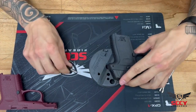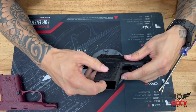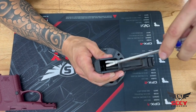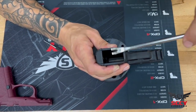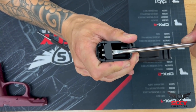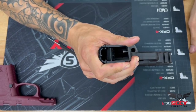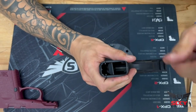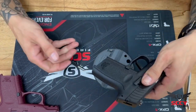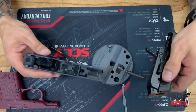After removing the rear frame pin, I'm going to move on to taking the butt cap of the hammer spring out of the grip. To do so, I'm going to use my fork tool — you don't need a lot of pressure, just a little bit of a lift on that retainer butt. I'm going to slowly lower it down into the magazine well, just getting it out of its home base. Then I'm going to put my hand on the slide and lightly wiggle and pull apart the grip.